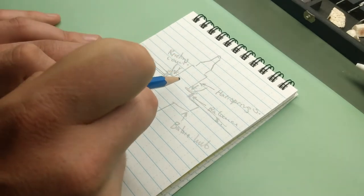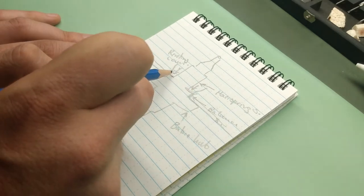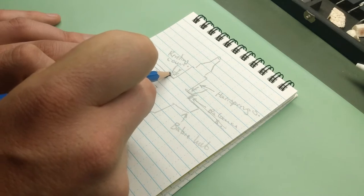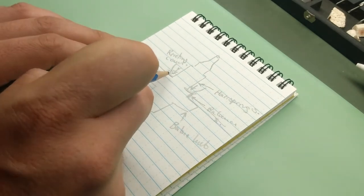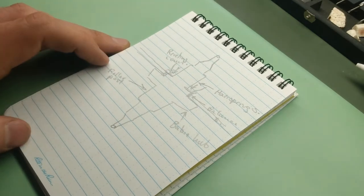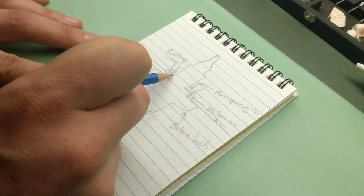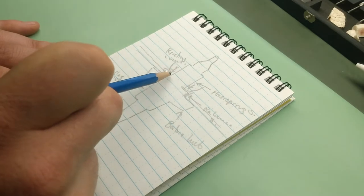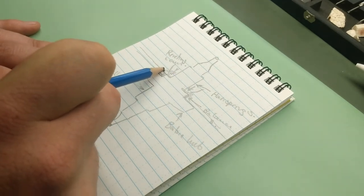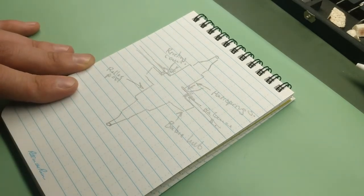Then we're going to come in with a domed punch, and when we exert downward pressure, we're going to spread out this riveting countersink and try to make a little lip over the edge of the balance hole. We want this riveting countersink to be spread out against the hole, and hopefully, although it can be difficult if your hole is somewhat enlarged, peen it, that is, spread it slightly over the edge of the balance hole. That's our objective. Then we come in with a flat punch and flatten down this rivet against the balance arms. That makes sure that when the hairspring collet goes on and grips the hairspring shoulder here, it can get all the way down to the level of the balance arms. So we want a rivet that, once it's done, is level with the balance arms. Okay, that's a very short version of what's our objective.